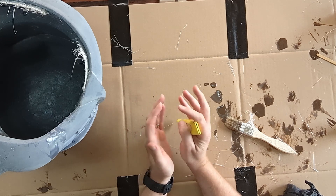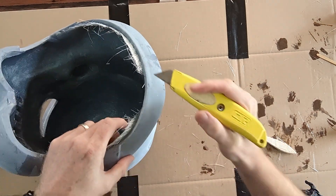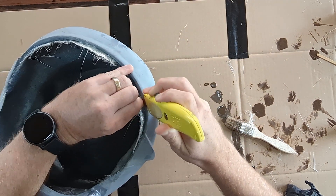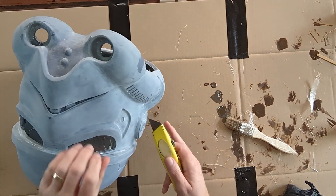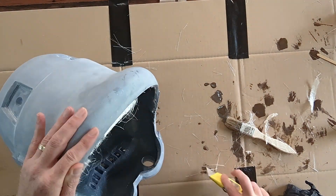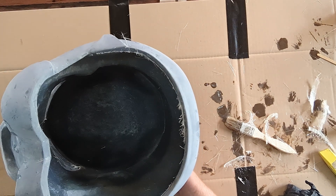It's been an hour now, so I'm going to attempt to clean off the edges of the fiberglass sheeting. I'm just using my knife here. I can see the resin still feels a little bit pliable - it's not rock hard yet. It's a little bit around the eye sockets that I want to clean up as well. There are still a few strands on the edges, but I'll be able to sand those off after this is all dried. I'm now going to leave this for a day and let it cure completely.